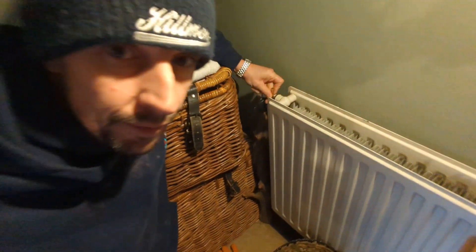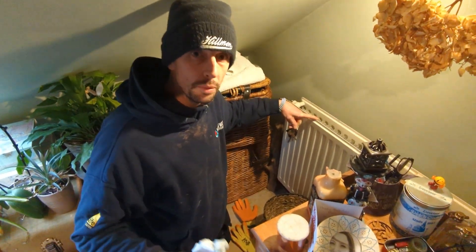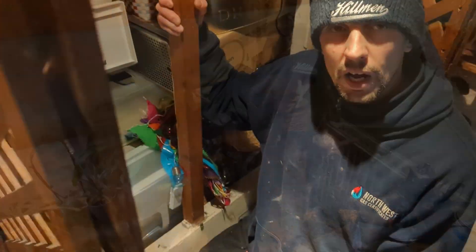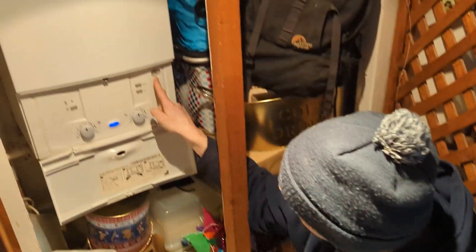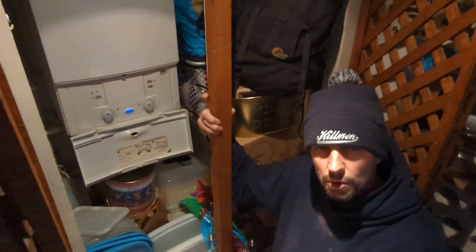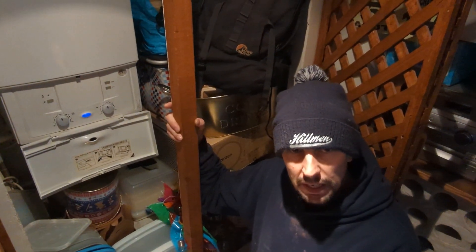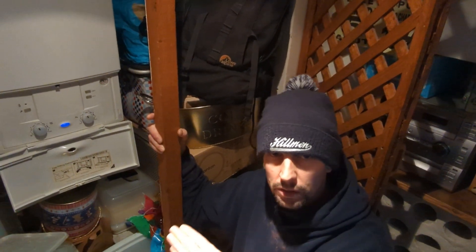This one's full of air. My friend just told me this one hasn't been heating up — and it won't be heating up because it's just full of air. So we're going to go back to the boiler and check what the pressure is now, and then come back and bleed it so we can see the difference in pressure and how it affects it. The boiler is on just under 1.5. We've been around the whole house and given each radiator a little bleed — only water came out, so the pressure has basically stayed the same at 1.5. We're going to go and bleed that final radiator, but if there's a lot of air in it, we'll come back and check the boiler to make sure the pressure doesn't go too low.